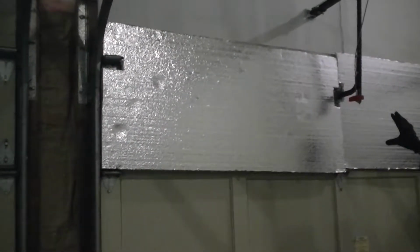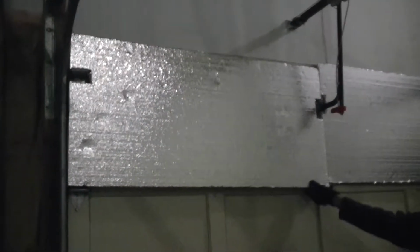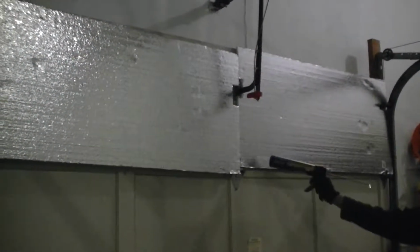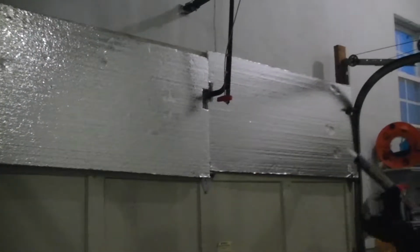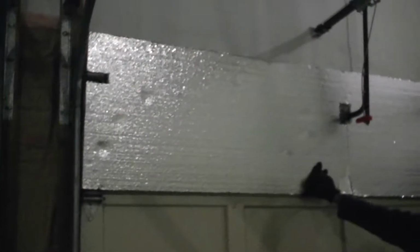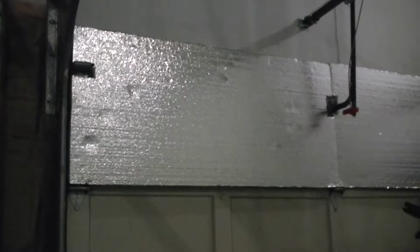So let me use this cut sheet on the garage door and paste it and show you the few pieces which I pasted over there. So I've cut the two pieces and I'm just trying to see how it looks. Basically they are not even right now because I have not used the liquid nail, but the idea is to put the liquid nail dots, four dots over here, 1, 2, 3, 4, and at the bottom 1, 2, 3, 4, and then two dots over here just to keep it steady on the garage door. So I'll do this for this one as well as for this one. So once it is done, I will let it dry and then it will be one even surface.